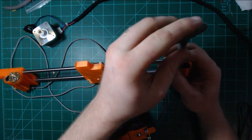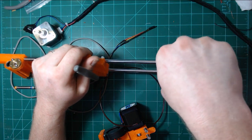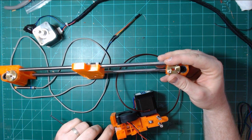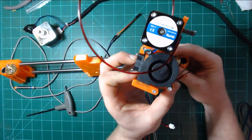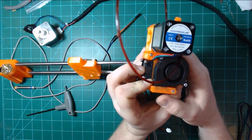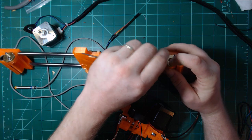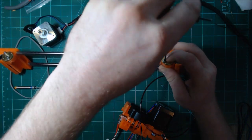Yeah, I was thinking about putting some LED strips on my extruder probably at some point. Every time I take a photo of a print, or even when I'm trying to look underneath the extruder, these extruders, with the old Greg's Wade, you had a lot more open area around the hot end, so you could see basically what was going on, or what the print head was doing. With these extruders, they're very close to the hot end tip, close to the same height. So they kind of shade or hide away a lot of the print area while it's going on. So it's harder to keep an eye on things, especially with the first layer and stuff. So it would be nice to have a LED strip or something to add a little more light for that.